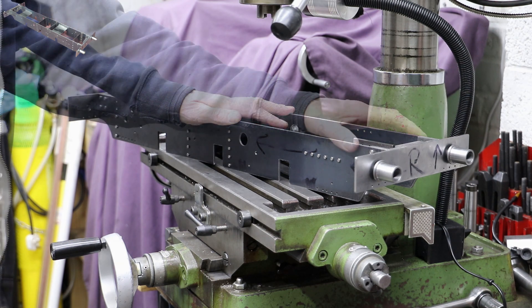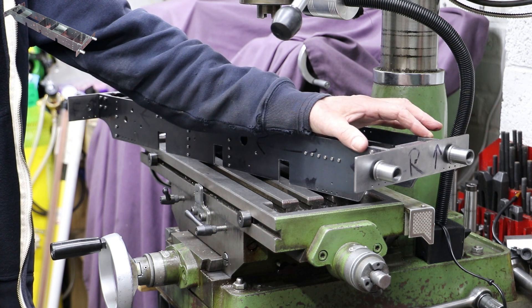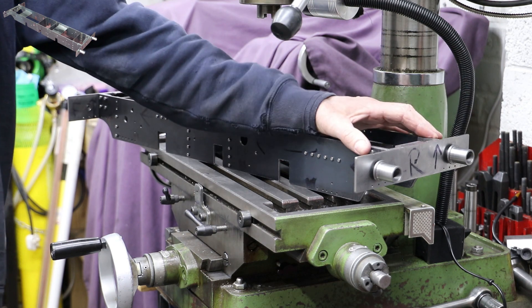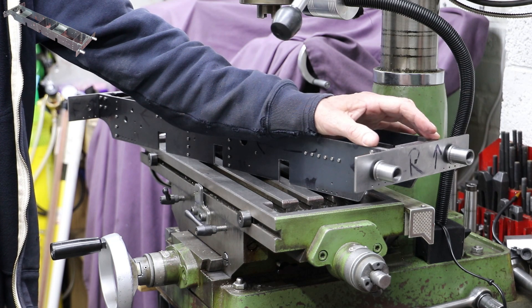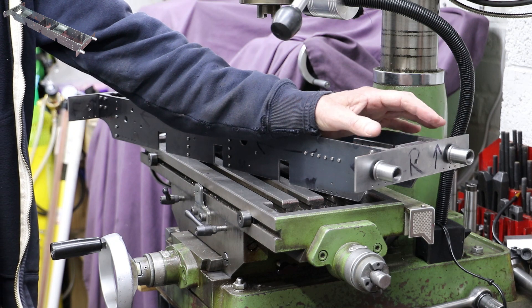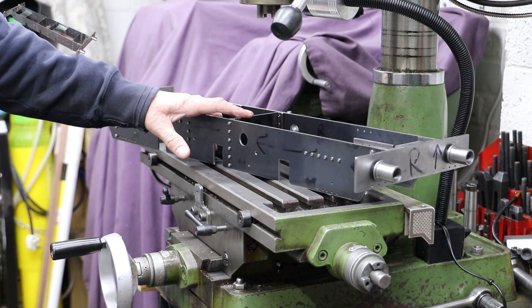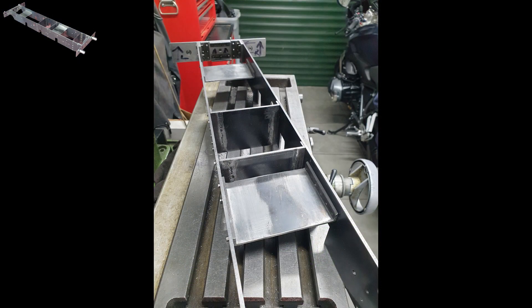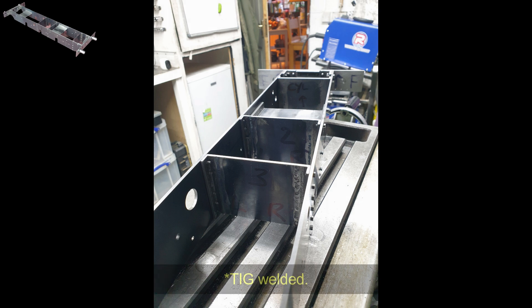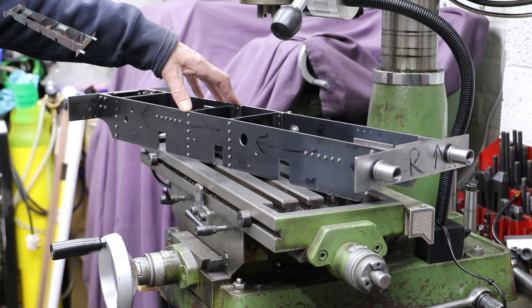There are some tweaks required. When I measured it I noticed that the rear of the frames on the rear buffer beam are slightly closer together than at the front - so it's pinched in at the back by about 0.2-0.3mm. That will mean the brackets on the buffer beam will need resetting, or conversely I could just try and get some shim material to put in there. In reality I don't think it's a big deal so I may even leave it. The two MIG welded stretchers I may reposition, because I got a bit carried away with the angle grinder when cleaning up the welds. The MIG weld bead is visible but ultimately these are unseen parts - they're functional and don't need to look good.